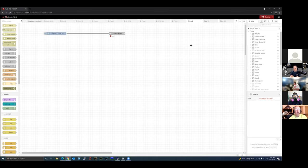No, the baud rate was correct, but that millisecond stuff, that's perfect. Yeah, I will play around with the millisecond. Yes, thank you. I think if it's defaulting to 10 seconds, it will time out. So try changing it down to start at 500 milliseconds.